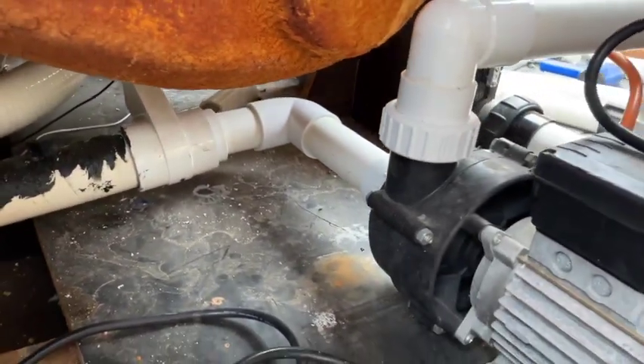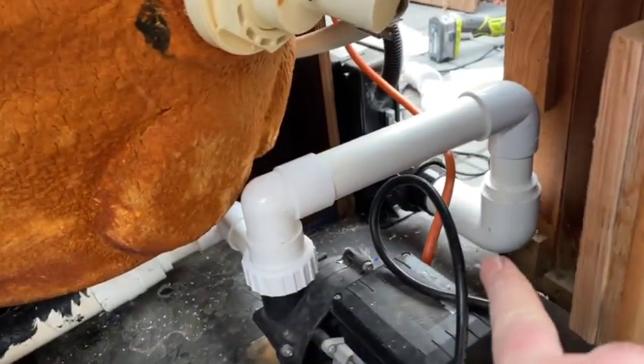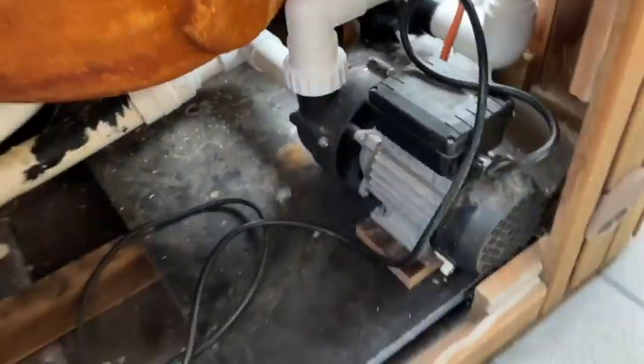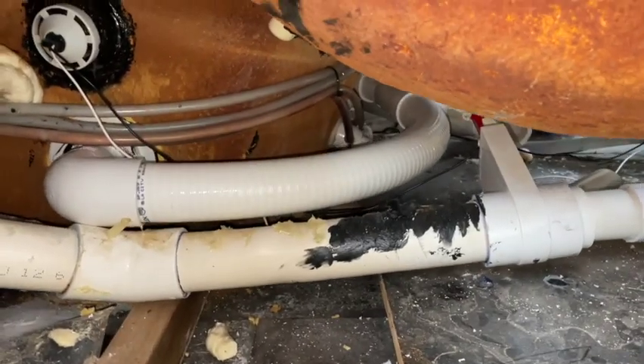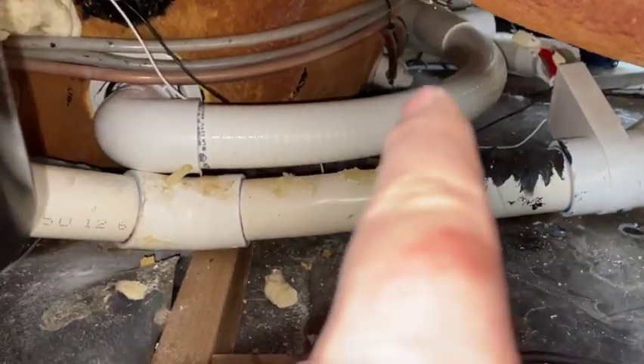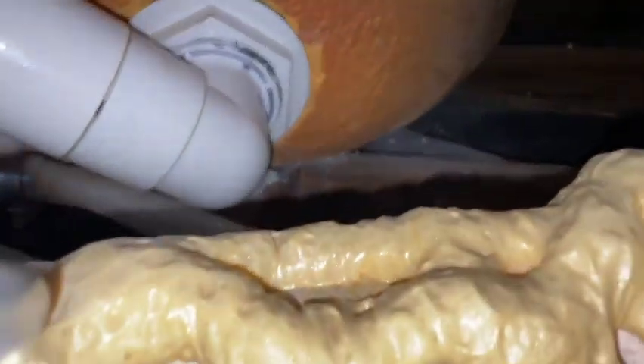Time for an update with the plumbing install. You can see the suction plumbed in on the side of the valve — I've reduced it straight from 50mm to 40mm. This is just a circ pump now so it doesn't have to be 50mm pipe — 40mm in, 40mm back out, with a 40-by-50 reducer going into the old plumbing across the front of the controller, and then out the other side up to a jet right here. The big suction is here, coming off with a 90 and then around — the flexible pipe is just brilliant for getting into a shape like that. The fitting you can see at the back there is the T. From this side and around, there's a 45 going down to a 90 where it goes into the suction, navigating all around those hoses.